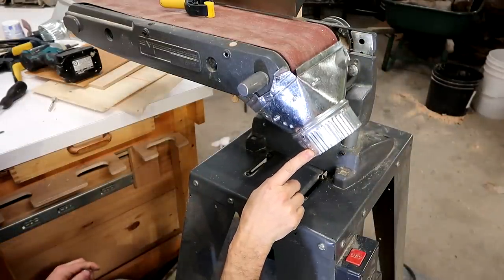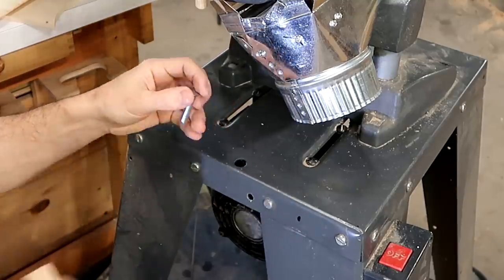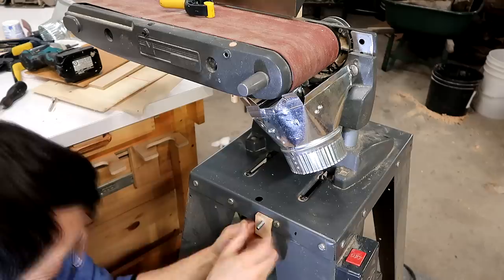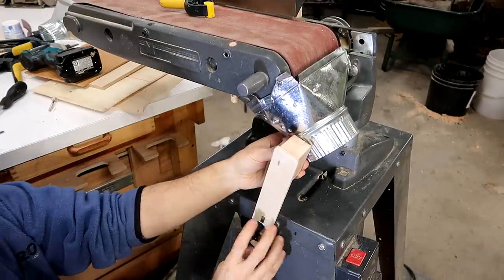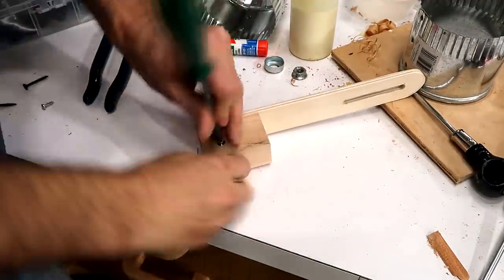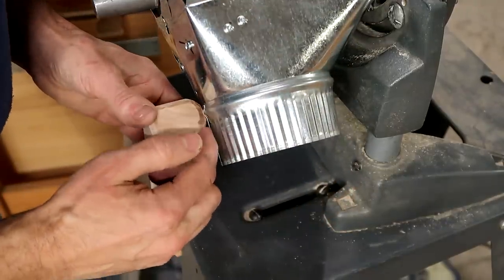Now I need a way to hold this in the right position, and I figured some kind of link that goes from here to here would be ideal. Maybe a screw from here, except this is at an angle, so I'd need some kind of angle block on here and something to keep the head from turning. I actually just made this block with an angle slot in it, and this notch in the back keeps the head from turning — it's held on by the screw that it holds. Then a washer on here, and I made this link which I'll connect to here somehow. That locks it in place. I also realized I need some room to mount the hose on here, so I cut away some of this block to give me a little bit more room.